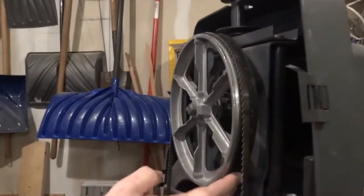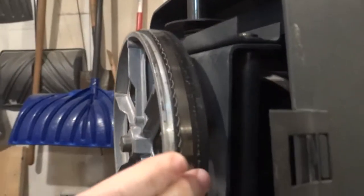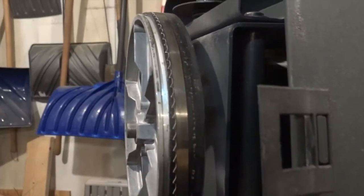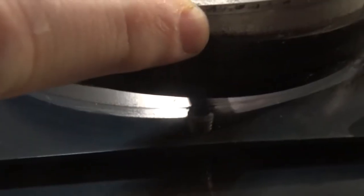While I searched a lot on the internet to find out what the problem was, we ended up having to troubleshoot ourselves. What it ended up being was the tire — this black band that you can see here. It's called the tire and it is intended to keep the blade centered, from moving right and left. This tire is no longer positioned correctly, and for the last few months we've had a problem with this tire actually flying off the wheel, and we could not figure out for the life of us what the problem was.